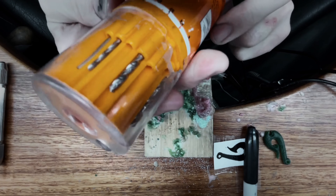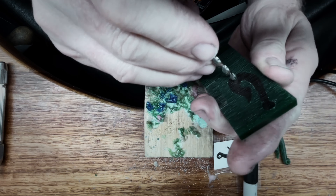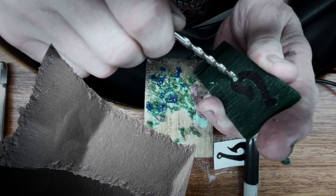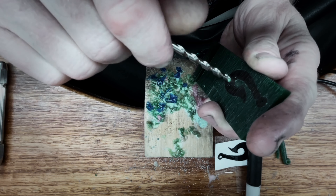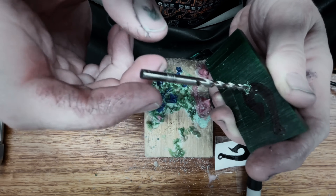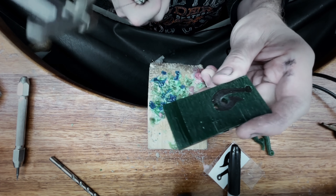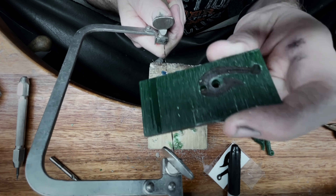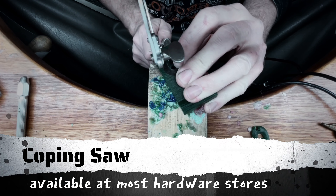First, before cutting this out, I'm going to use some drills. I've picked one the right size to fit into this section here. I'm doing it this way just in case you guys don't have micromotors. This is one way you can do it with limited tools, and it's very easy to pick up a set of drills from your hardware store. Now let's start cutting around the outline. I'm going to be using a jeweler saw with a wax saw blade, but you can probably buy a coping saw from the hardware store.